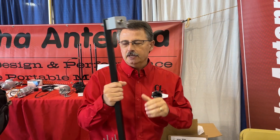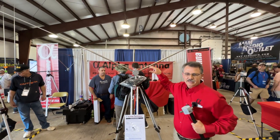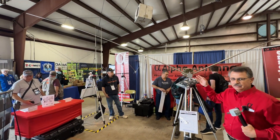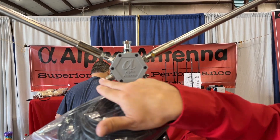The Yagi will do 2 through 20 meters. The hex tenna that a lot of people know will do 440 MHz, 220 MHz, and 2 meters through 40 meters at legal limit — right here on this heavy-duty tripod. This system can be deployed as a V-dipole, making it 50 ohms instead of 72 ohms as a flat top, with no coils, no balun, no tricks. It can also be a vertical, with the counterpoise deployed at the right angle to make it 50 ohms at the feed point.